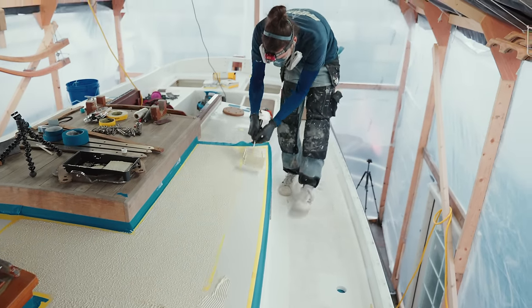You either pass again with the roller, or even the day later, we had a cat walk on it, for example, but then I just tap a little bit of Kiwi Grip in that area and try to make ridges. So it's forgiving and easy to fix. But the tape needs careful removal, pulling it off slowly, and then throw it away. Try not to get it onto the Kiwi Grip.